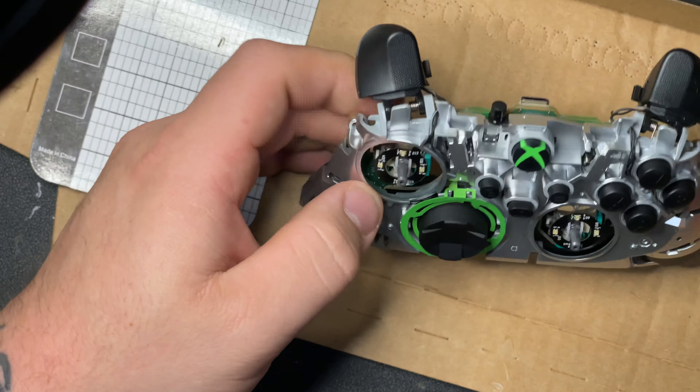Click your buttons to make sure it actually works. Basically you're done now, you just put everything back together. Reinstall the bumper buttons - they just kind of snap in, I push the triggers down and it kind of helps. Then put this cover back on.